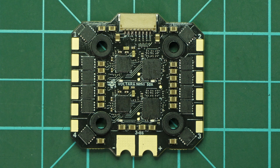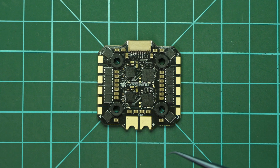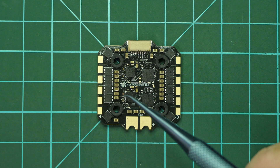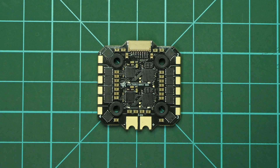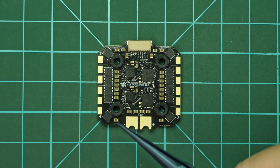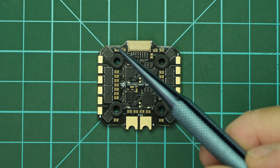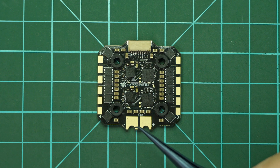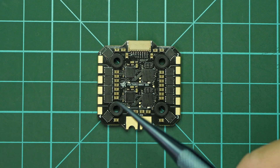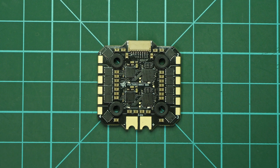Talking about physical and electrical specifications — it has the same PCB nano coating used to repel any water that gets on the PCB. Size-wise, the ESC is 37mm wide. Measuring the body, it's 33mm, and with the wings it comes to 37mm. So it's a bit wider than it is long, meaning it will be quite easy to install in almost any frame out there.